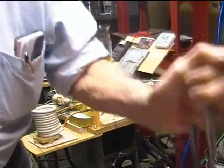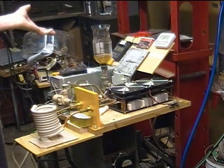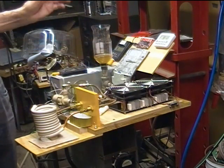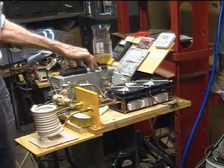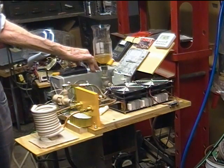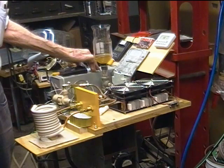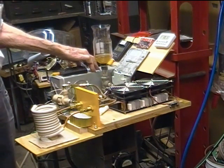The steel heats up pretty fast — 37.9 kilohertz. And that's really the end of today's test. My conclusion is that yes, it is okay if you have the proper power supply that's capable of delivering the current that you need without drooping. Yes, you may turn the circuit on with the work already in the work coil. You've seen three different current levels and as far as I can tell there were no negative effects of doing this. Thank you for watching.